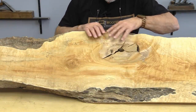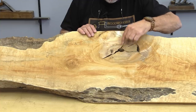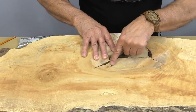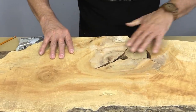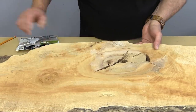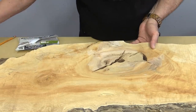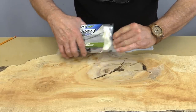Now for the next thing I want to show you this lovely piece of live edge lumber, but look at the nasty knot hole and crack in it and I'm going to show you how to fix that. What I want to tell you is that when you have something like this, don't try and hide it — use this to make it a feature rather than trying to disguise it. In this case we're going to make it look a little bit darker, which is quite fine since knots are very often darker. In the past I've showed you this Titebond product — I love it, it's a CA glue with a black dye in it, perfect for little holes and little cracks — but for something like these great big ones I'm going to use something today called EcoPoxy.